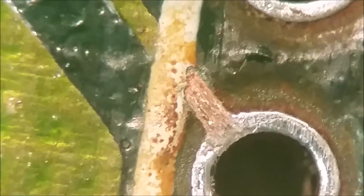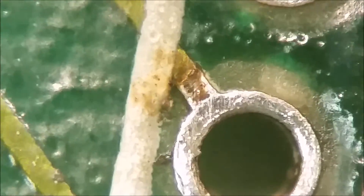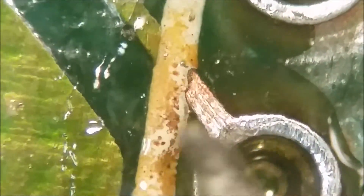What I did is I put a little bit of flux on there and used a blade and scraped these two back. You can see this one's still got the black on it. So that's what you do — you flux them out and reflow them. Let me grab the soldering iron. Then you just use some of the solder that's already on it and just kind of reflow it up into it like that. That's what you gotta do.